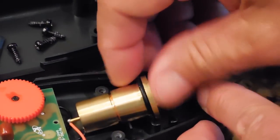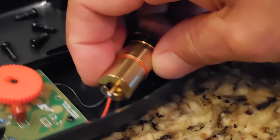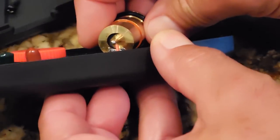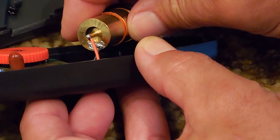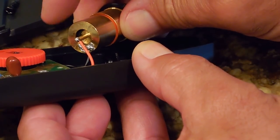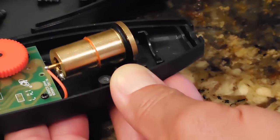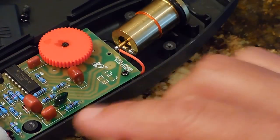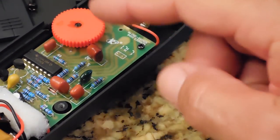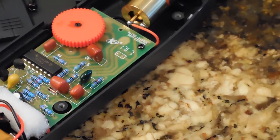Now a closer look at this piece. There's actually an opening in there, so the center pin is isolated from where the black wire is soldered onto the body — which is the negative. My best guess is that there's a quartz crystal inside here. As those vibrations are picked up, a very small voltage is generated inside the cylinder. Then the integrated circuit interprets that signal and drives the speakers inside your headset. More vibration gives higher voltage from the quartz crystal; less vibration gives lower voltage.